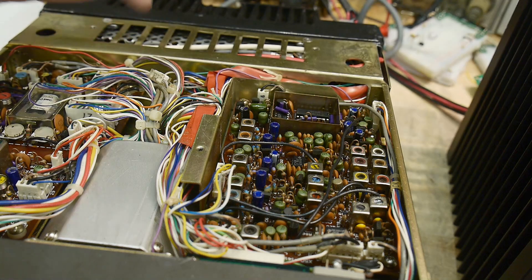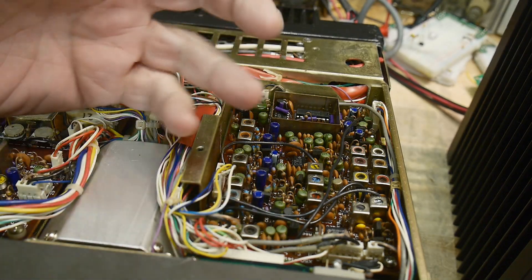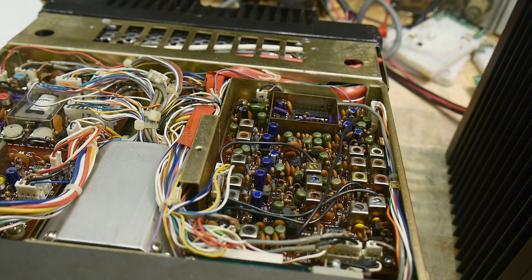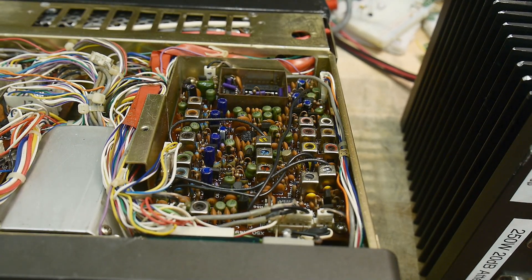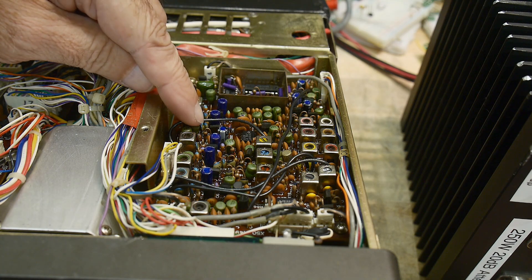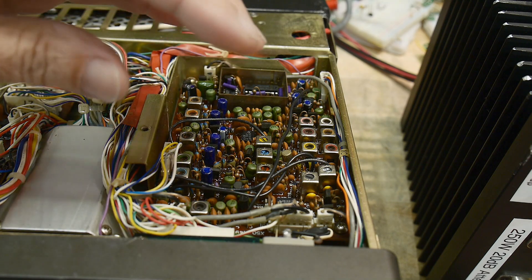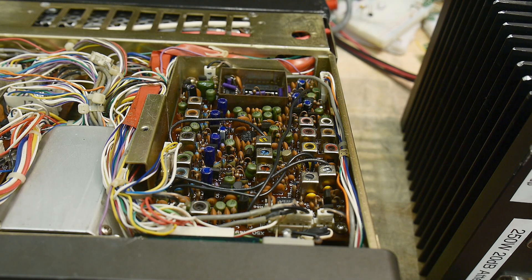There's something going on here, and I had found that on my own — I just wasn't getting anything on the output of the board until sometime later, and then it all worked. I got some great advice from Mike over at Mike's Radio Repair. He said these transistors that are used — they're weird, they're like TO-92s but they're square. They're 2SC460s, and he said that the ones Kenwood used were known to sort of get sick. The way they get sick is they lose their gain, and when they don't have enough gain, the phase lock loop doesn't operate. By some strange mechanism, once they heat up and get warm, they have more gain, and then the thing starts to work — and that's exactly my radio.